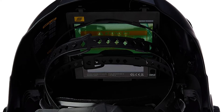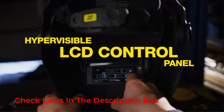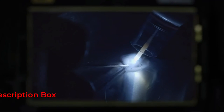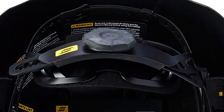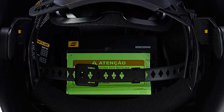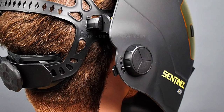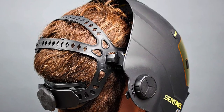As a piece that's not standardized across the industry, replacements are costly. Some users complain of glare and fisheye effects through this viewport. One place where ESAB seems to have hit a home run is with the 5-point headgear. This design features a basket shape that fits over the top of the head like many hard hats use. The 5-point headgear allows shifting the weight of the helmet in different directions for difficult welding situations like lying on your side.